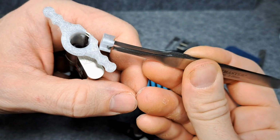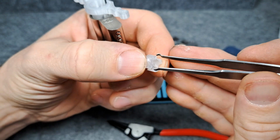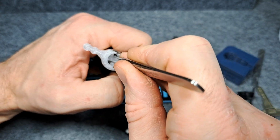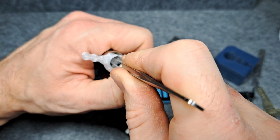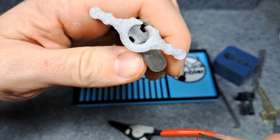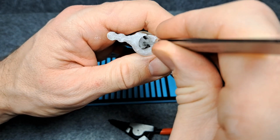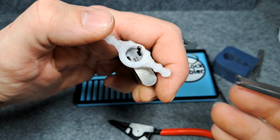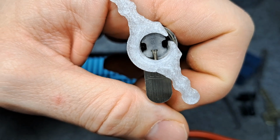Oh, quick fast forward break. I want to show you my newest addition to gutting. This is just an insert because I was dropping all the pins all the time when doing gutting like this. This insert stops the pin first of all. Then you can align it. And it doesn't fall into the core, but it stays in place. And then you can easily gut the lock.